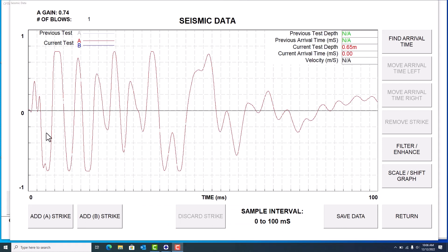Once you choose which geophone you want to use, you'll see it makes the blue wave go away, even though that's the one we chose. It actually turns the blue wave into a red wave — because now, instead of red meaning geophone one and blue meaning geophone two, the red wave now means A strike and the blue wave means B strike. So forget what color the waves were before. Now the colors mean something different: red wave means A strike, blue wave means B strike, and we're using the same geophone throughout the entire test.